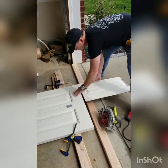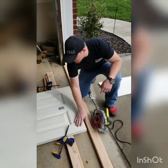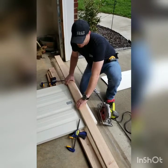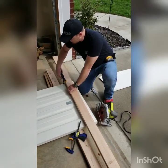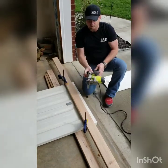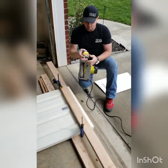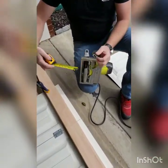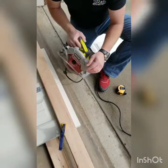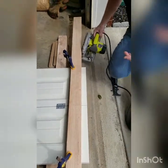What we did is we measured the distance of the opening when we brought the bottom of the opening up. When you cut the bottom of this panel, you make your measurements. I used a straight edge — a 2x4 because I had one handy — but you can use a level or anything that's straight. Always clamp it on the inside so your saw can pass by it without hitting it. When you go to set your measurement to cut, your guard is going to be against the wood, so you need to measure how far your blade is going to be from the edge. That one is an inch and three-eighths, so you make that measurement from your mark. When you cut, your blade will skirt right along the edge and give you a flat, straight surface.